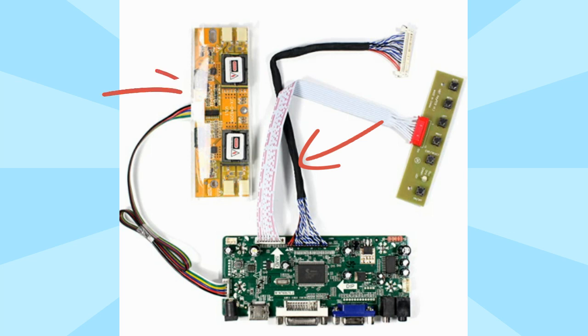I also needed a way to power the lights. The particular card I bought happened to have an inverter board with four CCFL ports for the lights, and the Dell just happened to have four CCFL lights on it. So I could use that inverter board, plug it up to the lights, and then plug that inverter board into the Arcade1Up. That's what I did — I didn't need anything else from the LCD controller board, just the LVDS cable, the inverter board, and the cable for the inverter board.